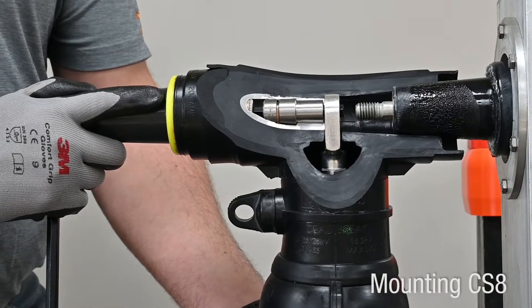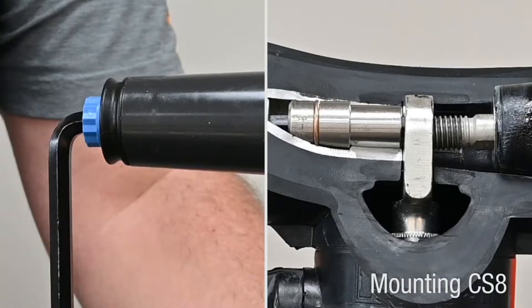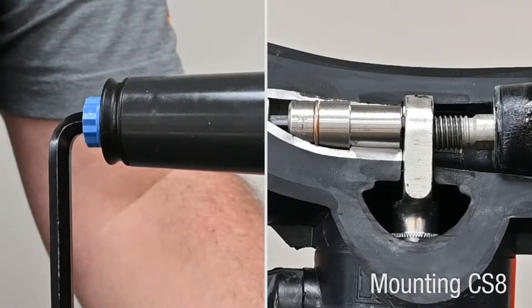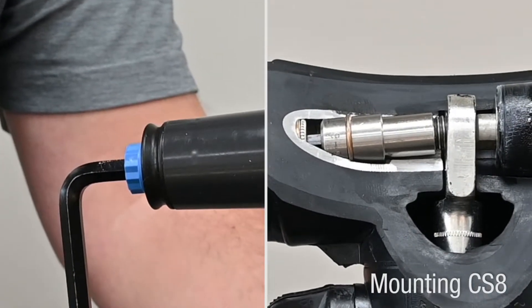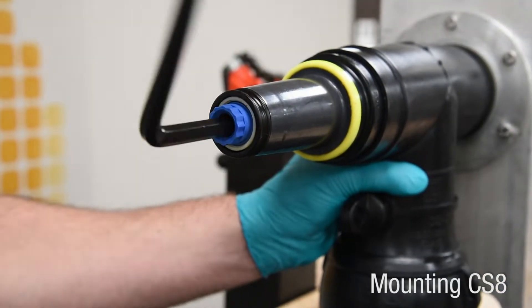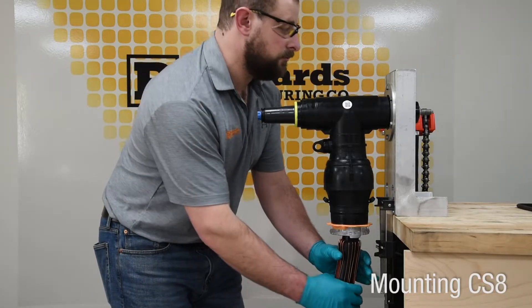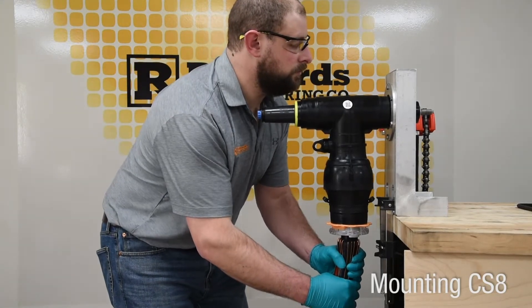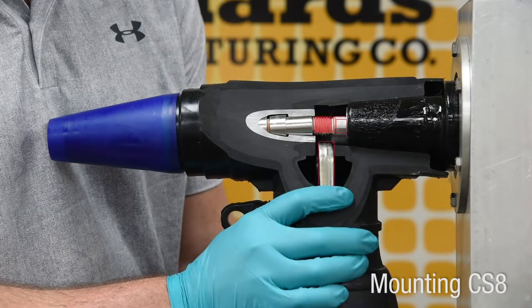Ensuring the tool stays fully inserted, grasp the power cable and mount assembly. Note the action shown in the close-up view. Once the tool meets the stud, the stud should push the tool out slightly, replacing its position in the lug hole. Rotate the tool two to three turns to start thread engagement. As an additional check that the stud is through the hole in the lug, tug on the power cable. Only a small amount of movement should be possible. Any significant movement of the cable indicates the assembly is misaligned and the seating step should be repeated.